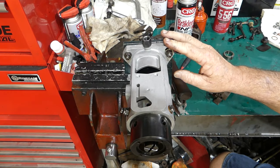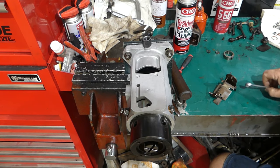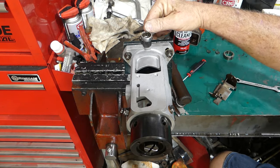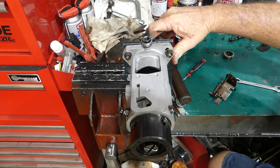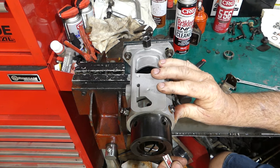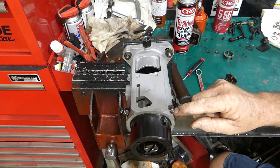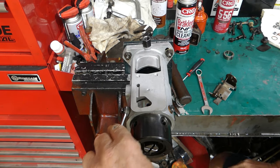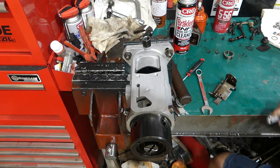I've put the pump in the bracket in my vice. I've fitted the crank drain with a copper or aluminium washer, nipped up firm so it won't leak. The big bolt down the bottom holding the head in is nipped up, and I've also fitted the bolt on the front of the pump where the plate is, plus the bleed screw that you can access later. Both hold the head in place with a copper washer — nip them up firm, job done.